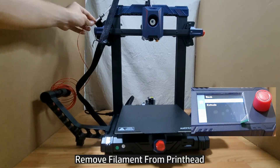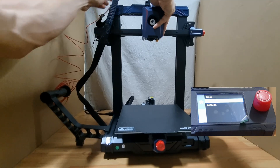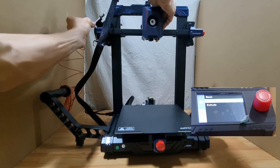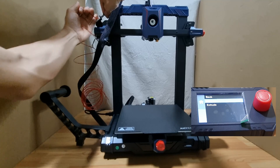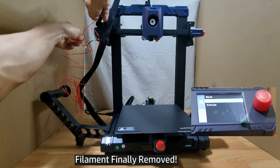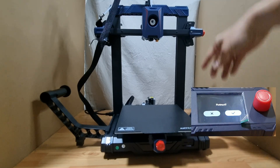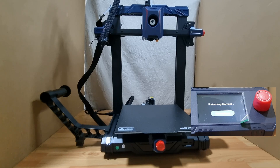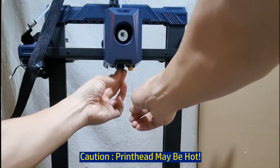I'm going to attempt to remove the filament again — it's very difficult to pull out. We have to pull out the filament. Let's remove that and try to retract again. The retract is done, so let's attempt to clear the nozzle again.